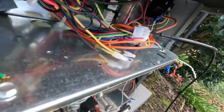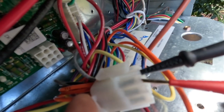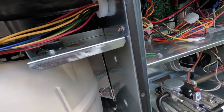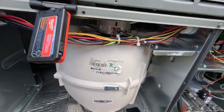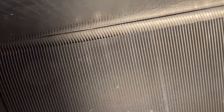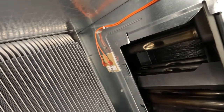If I go to the purple one — that's checking my rollout — continuity there. So we have continuity from the rollout but not the primary limit. Let's slide this out. These should be automatic reset limits and not a one-and-done type. Microchannel coil — they've got some issues in their future. Anyway, there's the limit sitting back here by the blower. I've got the housing slid out; the heat exchanger is back there. Let me get that limit out and check it.